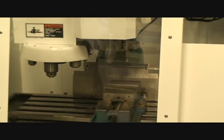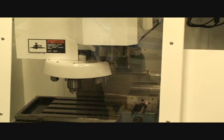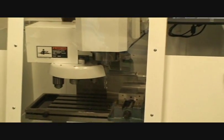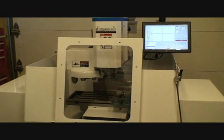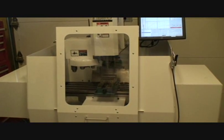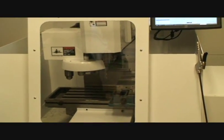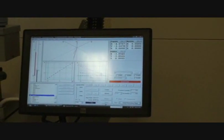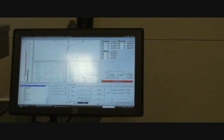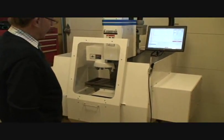It's about seven or eight seconds. This has a Flash Cut control on it, which is really a good control. It's very user friendly — I call it a plug-and-play because you can literally be up and running in 15 minutes. To interface anything to the control is very simple. It's all done on screen. We have 16 outputs and 16 inputs. You just go to configuration and type in what the M-code is and the output you want on, and that's it.